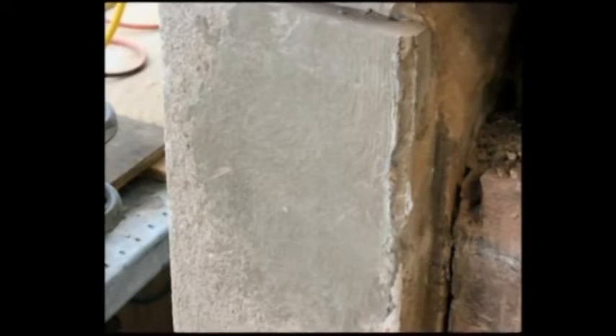This illustration shows the large area of the window jamb on the east elevation with the previous Portland cement mortar patch. This was the area selected for the Dutchman removal and replacement. We used the reclaimed stone from a remove and replace training operation previously conducted at the site on the same elevation.